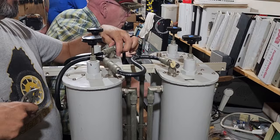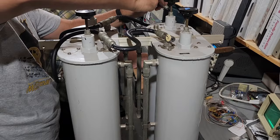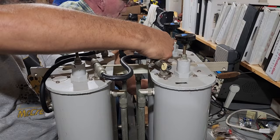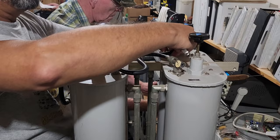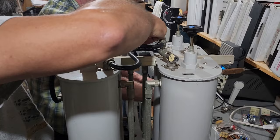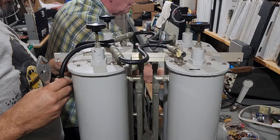We've got a different harness on these. What we're going to do is tune these duplexers for 146.880 for transmit and 146.280 for the incoming signal or receive signal. So we don't have to come up very much with these duplexers. Don has already put arrows on the tops of those dials — the screws on the top — to show original orientation. We're going to use those blue arrows as we move those dials clockwise and counterclockwise as we begin to tune these cans. We are going to use a service monitor, which Don is looking at. We also have a Kenwood radio that we're going to use on both 146.280 and 146.880.